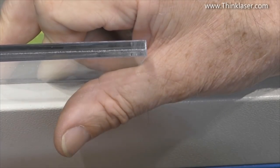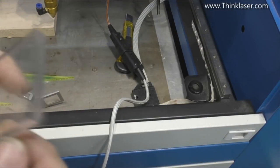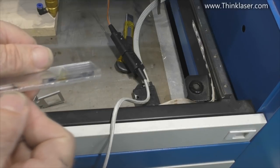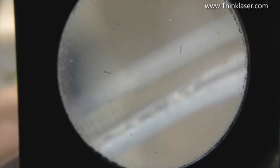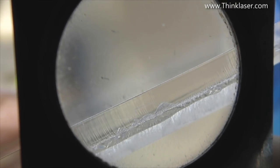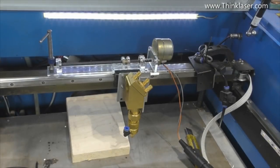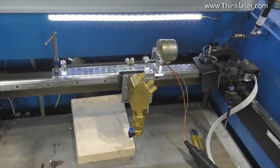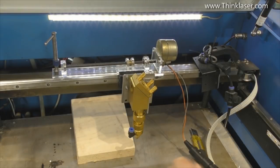I've hacked away the front edge of the material, ground away the bottom and broken it so I don't damage the internal surface, so we can see the striations. Look at the bottom left-hand corner - you can clearly see the striations coming down and curling away at the bottom. The first question we have to ask is: how is it possible to get these striations when we don't have any intermittent movement, no pulsing air, and we know we've got a steady beam?